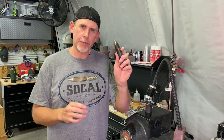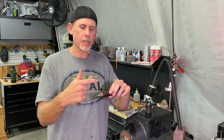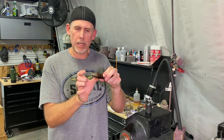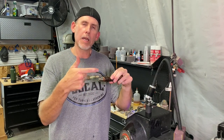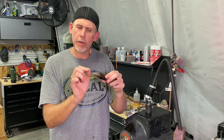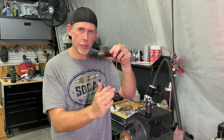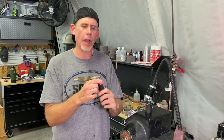But first things first, the drill holes. So there's two drill bits. You're going to use a 23/64 drill bit. Drill that one first, and that's going to be long enough to fit the threaded rod in. And then the second one's going to be a half inch hole, and you want to drill that just deep enough so that the threaded insert is flush with the end of your blank. So you'll want to sneak up on that one.